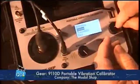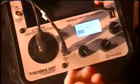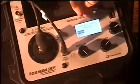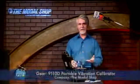There are a couple of other things I want to show you. Going back into the tools menu under options, you can set date and time. There's also a calibration interval setting — pretty cool. By default it's set to 12 months, but you can change it. What's important is that a month before the calibration due date, any time you power up the 9110 it's going to remind you that your calibration is coming due. So once you're within a month, you'll be constantly reminded every time you power it up — you should never have an excuse for skipping calibration.